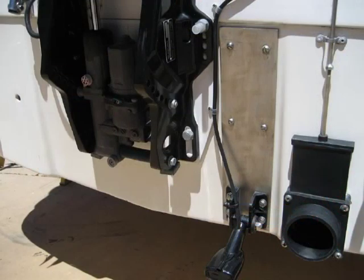I took a scrap plate of quarter-inch 316 stainless steel and tapped threads for the fish finder, then drilled and through-bolted it above the water ballast into the stern above the waterline, coating the threads with 3M 5200 marine adhesive sealant. I still have a drip-tight hull.